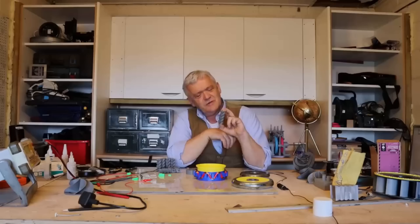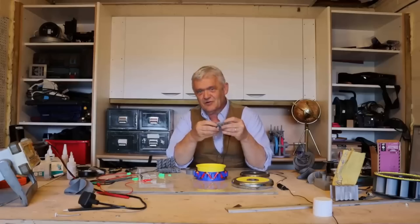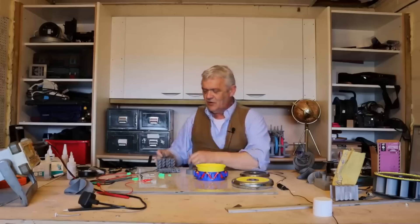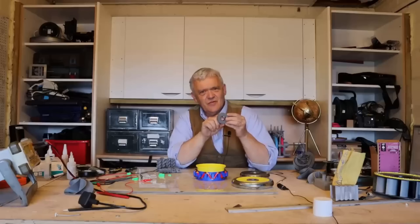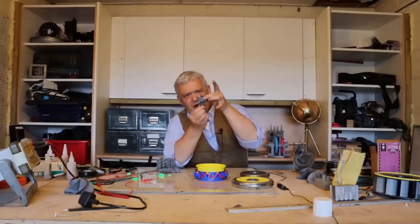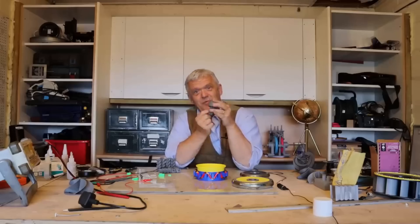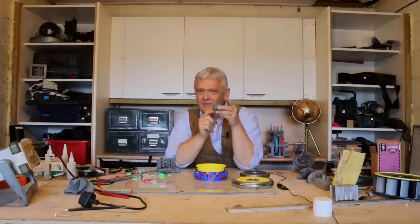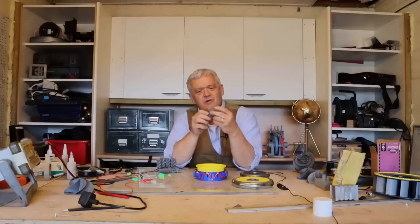Now I made a medium version at 60 millimeters long, and I've printed 10 of those because they will glue together to make a nice twist spiral that's actually quite long. And of course you can change that length as much as you want. The only other thing we really need is this section and the ratchet section. This section is a rider — it's actually just a ring with four indents in it that are big enough to take 12 millimeter ball bearings. They squeeze in there quite tightly and the ring will hold those in place. That ring fits on the twist like that, and if I let that go, of course it drops, and as it drops it will spin. And what we're going to do is connect that to a new ratchet mechanism and glue all of these together to make one long spiral.